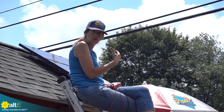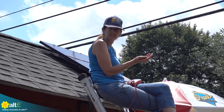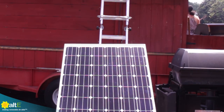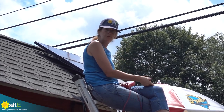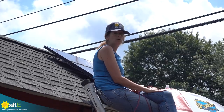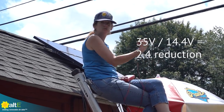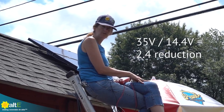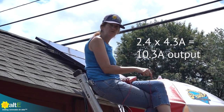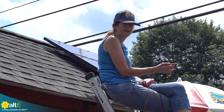The thing we're going to notice is we can't use a PWM charge controller. We had a PWM charge controller in there — the Xantrex C40 — and we're replacing it with an MPPT charge controller. If we tried to put this 20-volt solar panel through the PWM charge controller, we'd drop the volts and keep the amps low, easily losing half the power. By using a Blue Sky MPPT charge controller, it takes the high voltage from the solar panel and drops it down to the low voltage needed for the 12-volt battery. In doing so, it raises the current on the output because watts equals volts times amps — drop the volts, raise the amps, you don't lose any power. With an MPPT charge controller, we're going to greatly increase our output.